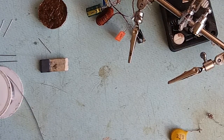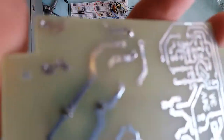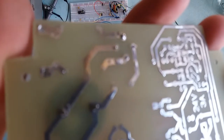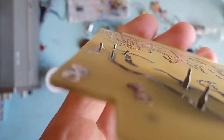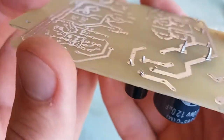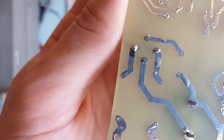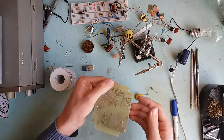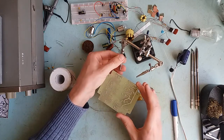That is just a beautiful joint, could use a little bit more solder though — just a tad bit more. As you can see, it's a concave shape. I would call it acceptable but it could use just a little bit more solder. As you can see, you don't necessarily need additional flux if your board is clean and your component leads are clean. I cheated though — I went and prepared the leads of the components in advance.